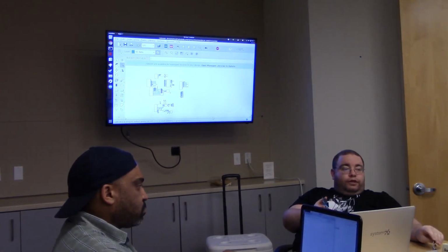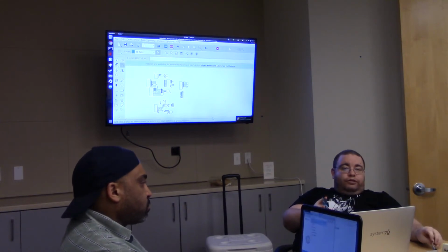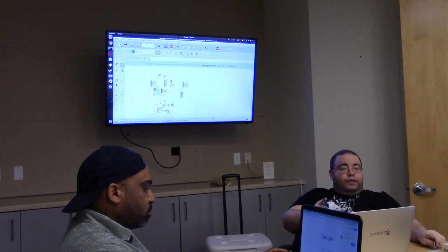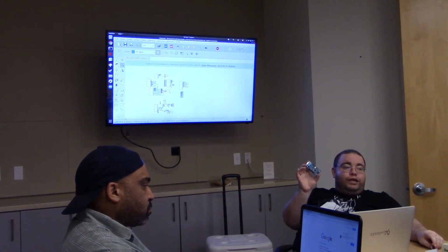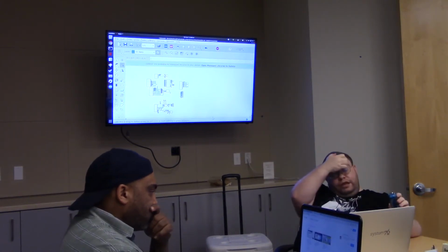Text mode I can do too. Text mode is 80 by 25 by 1 byte per character, which is not a whole lot, so there's plenty of room for text in there. I will eventually make some kind of text thing. What's concerning me right now is that with this thing, I can read from this RAM and display stuff at 320 by 240 by 8-bit pixels. What I can't do is write to the RAM.